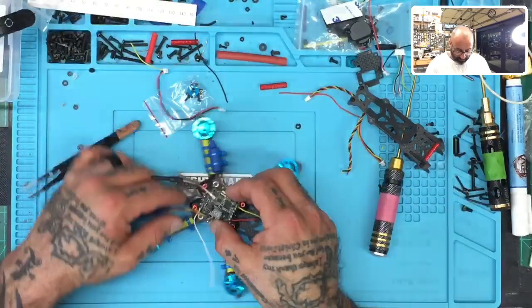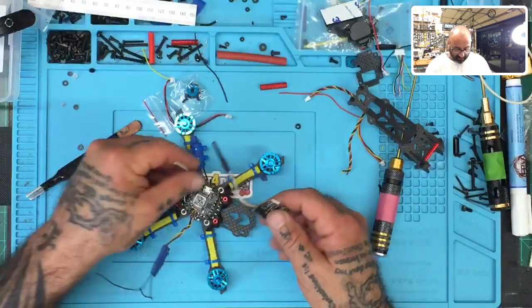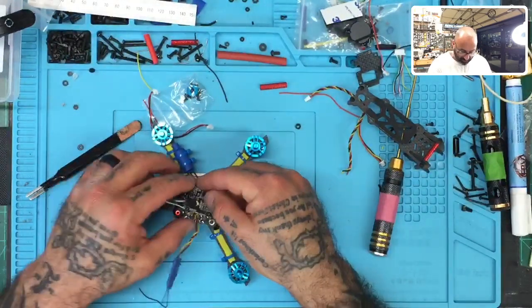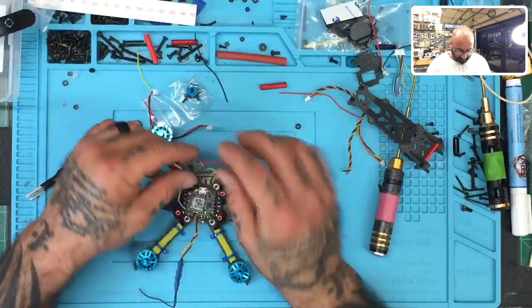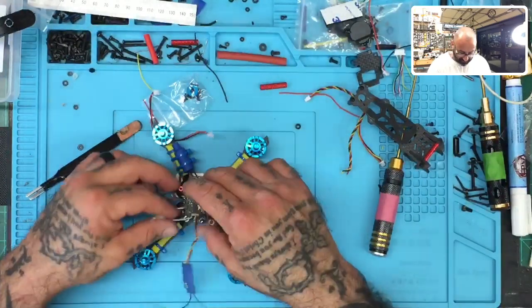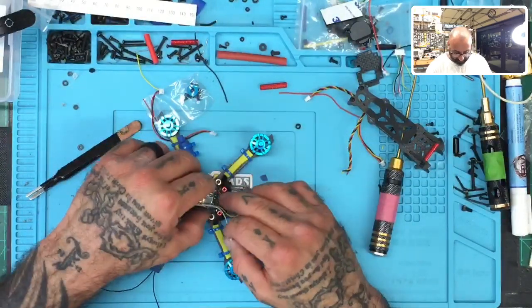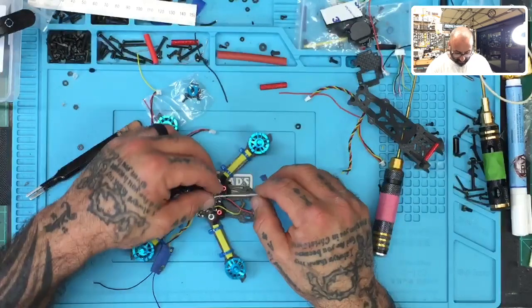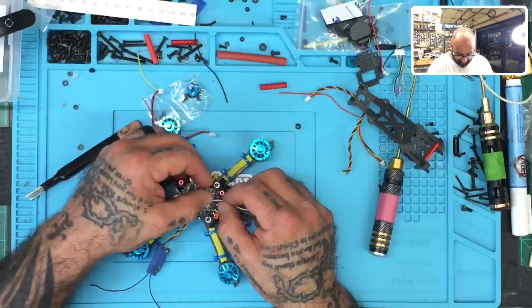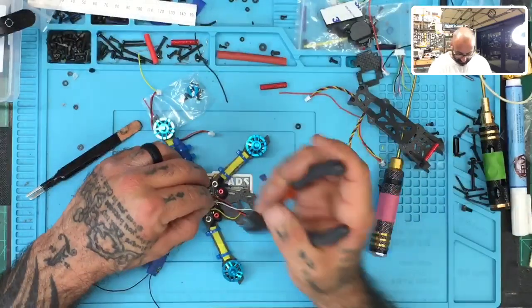If we know it's going to sit like this, the first thing I want to do is get this smart audio out of the way, get it soldered and closed up, right? I would recommend the way we're going to do this is we're going to lean the VTX like this, and we're going to bring the wire over. Just kind of stick it onto those screw areas right there. Bring the wire over and measure the distance you need, which is going to be pretty much like that. And then from there, just go ahead and cut it.